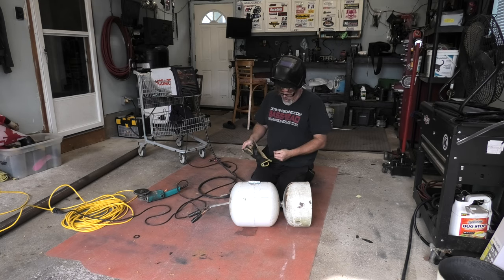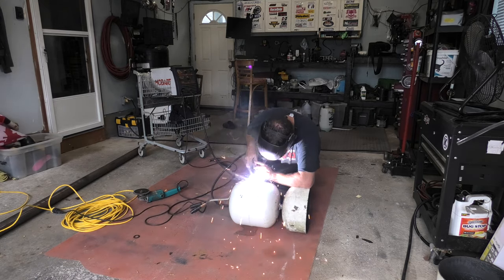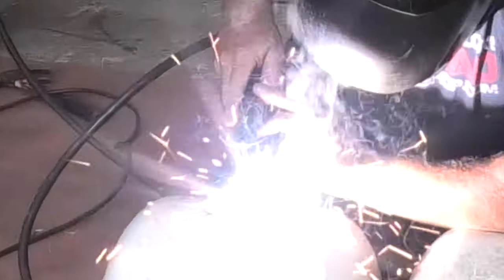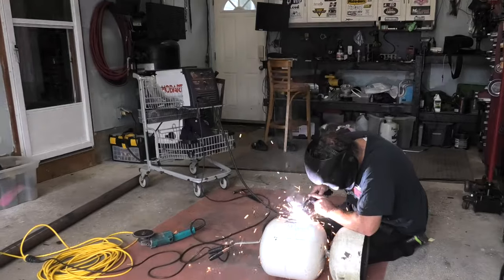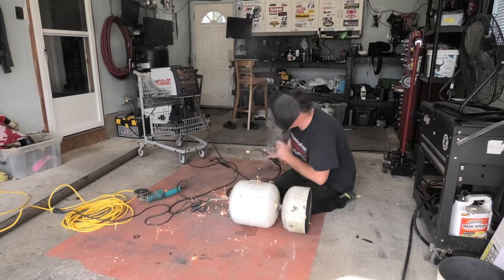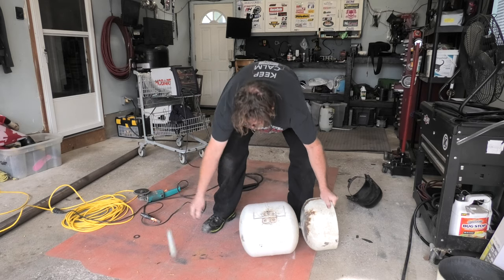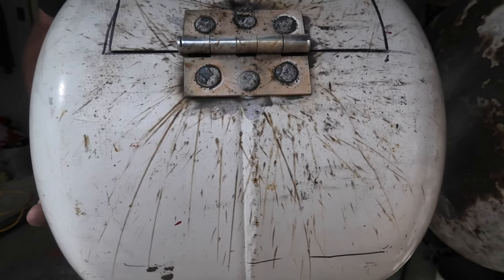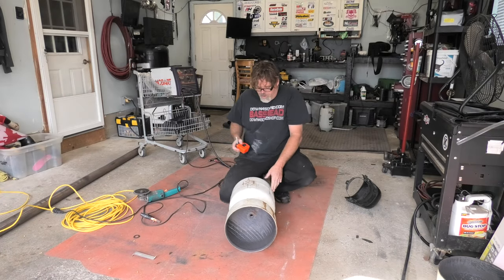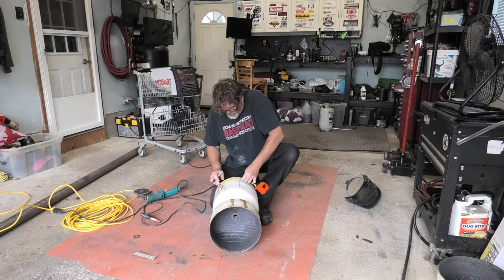The glove is useless but that tack felt decent. So what I did was welded where the holes were for the hinge — basically she should be set. Now finish cutting that door open and we'll have a door. I'm going to measure from there to here — let's do the door six inches, right in the sweet spot.